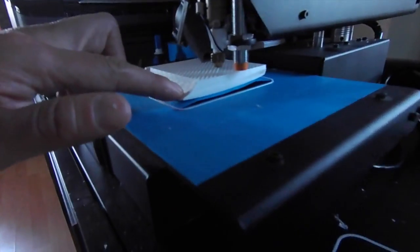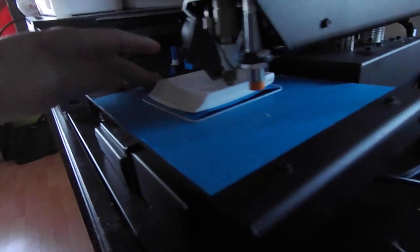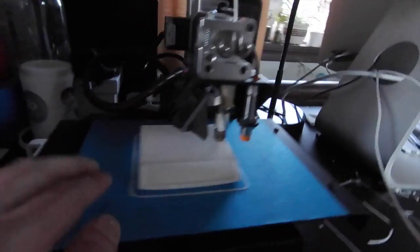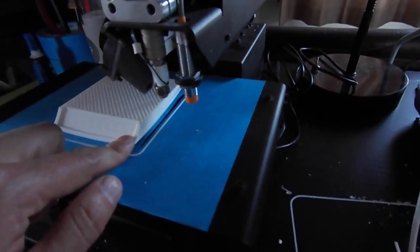So this is actually so curved it might be problematic. I'm gonna let it finish printing just so that we have this one already printed. But after it's done, we're gonna build another one with a raft underneath to see if that helps to prevent this problem. Now the reason that this happens at all is because as the lower plastic cools down and the next layer of plastic is coming on top, the one that's hotter is more expanded than the ones that are underneath cooling.